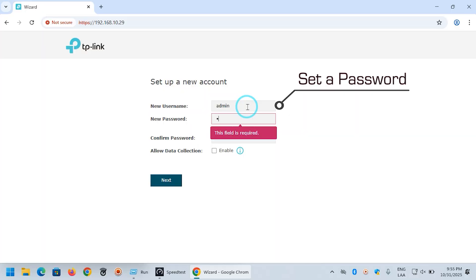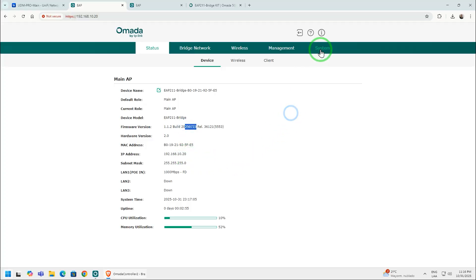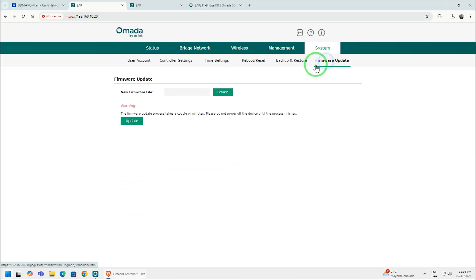As for recommendations, there are just a few. First of all, even if in a hurry, you cannot miss setting the admin passwords of your access points — same thing for your SSIDs. Second, do not forget to upgrade the firmware of the units, as it may be addressing performance as well as security issues that are important. And finally, even though protected by 60kV surge protection, many of you may know that such protections are worthless if your devices are not properly grounded.